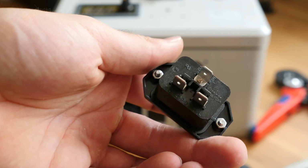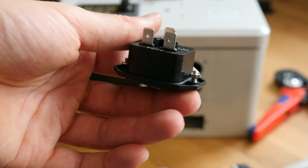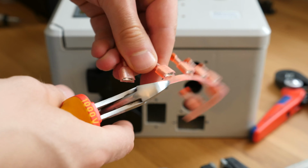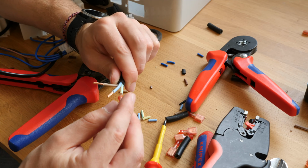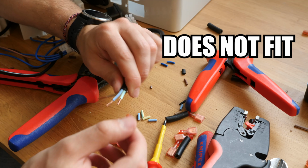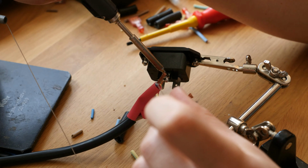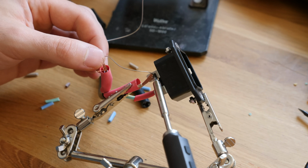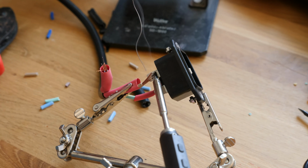For the AC input terminals, usually crimping is required. However, the cables I've used were too thick, so I had to solder them, which is not optimal since the cable might just heat up, which might cause the solder to melt, your brewing control to catch fire, your house to burn down and you to die. You get the point. Having a shrink hose in place is absolutely crucial to provide at least some insulation to the connector.